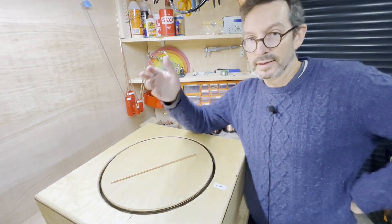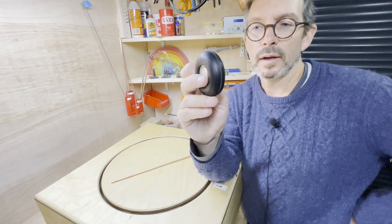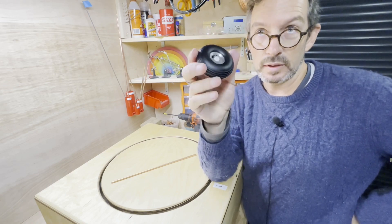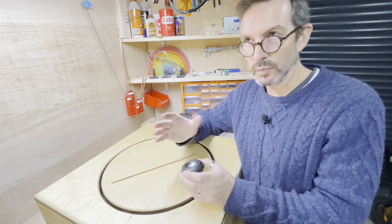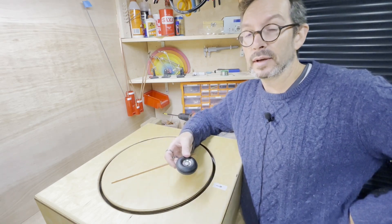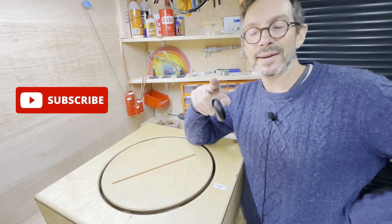Thanks very much for watching, that is the end of episode two. In the next episode I'll be working on the motor. I've got this little rubber wheel that needs to be attached to a motor, so I need to sort out the power supply, the switch, a speed controller, work out where I'm going to mount that, how I'm going to attach it, and where all the wires will be hidden. This needs to rub against the inside of the bearing, so I need to make a frame - probably spring-loaded and hinged so it can push on the bearing at all times. You can turn it on, turn the speed up, and this will slowly rotate the bearing. That will be in the next episode - please subscribe, I'll see you then, bye!